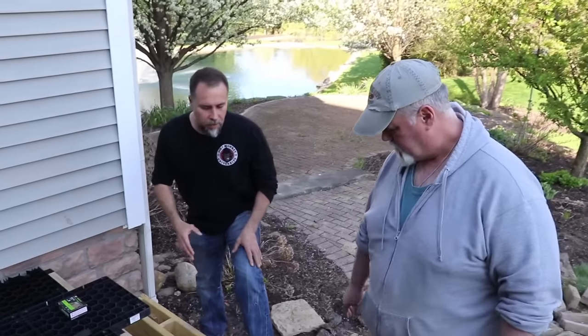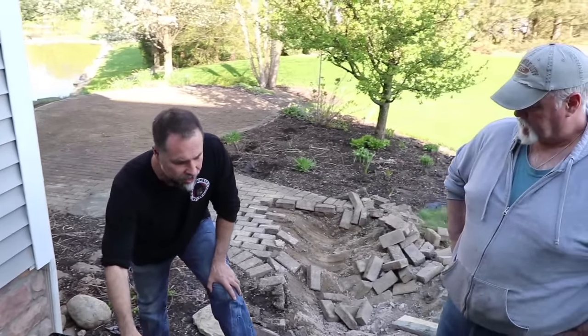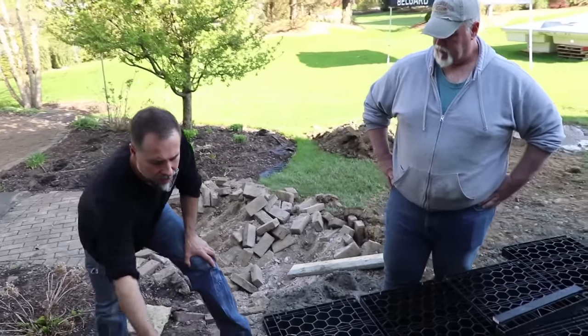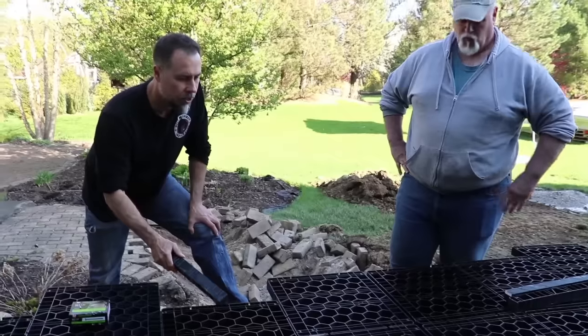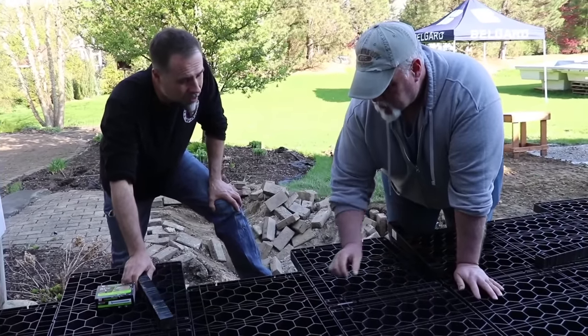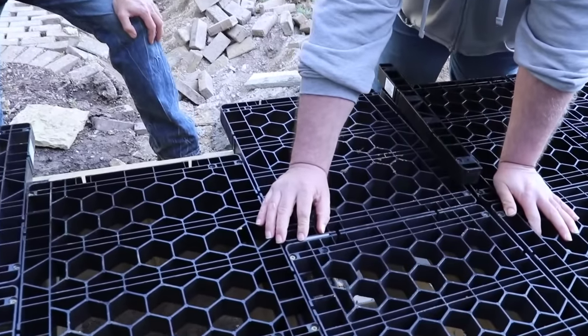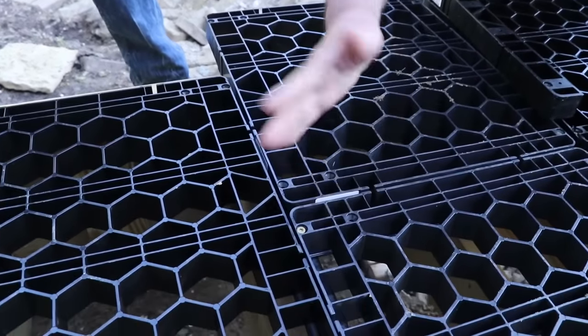I want to show something, Mike. We were talking about you've got this overlapped right over the actual timber framing. Right. And then you actually stagger the joints. I've noticed that, right? Is that the norm? You don't want screws right next to each other. It weakens the joist a little bit. I mean, not noticeably, but if you stagger them, you don't have that issue.